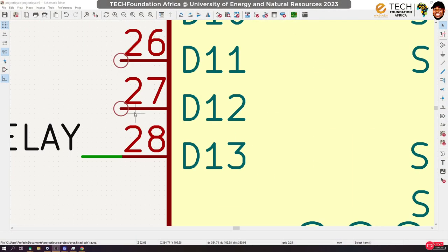Actually, we can just use the buzzer without it. Let's just use the buzzer without it. So for this operation, I'm not going to hook up the buzzer to the pulse width modulation pin, because I actually need the last three for something else. There are three more left and I need them for something else. So let's just hook up the buzzer to pin 12.